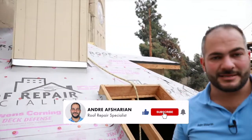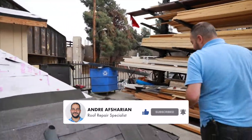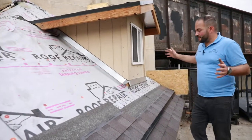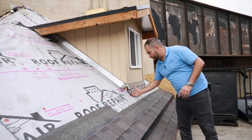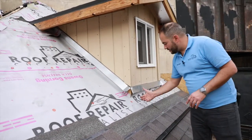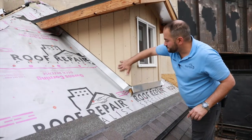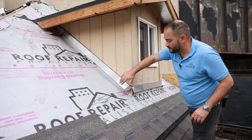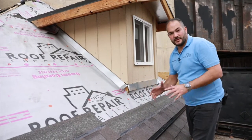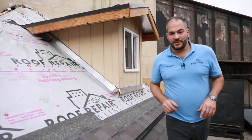It's going to be the same flashing details. Another common area that the same flashing is used — let's say you have a dormer window sticking out of your roof. So you're going to have the same flashing on your chimneys, on your dormers, or on your skylights. Whether it's a head wall — this is called the head wall — or this is called the gable wall. We're going to use step flashing here, and one metal here. They're all the same theories, let's get into it and I'll show you how to properly install those pieces of flashing.